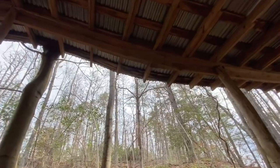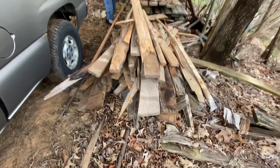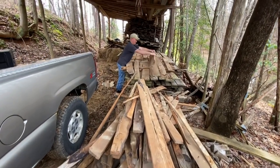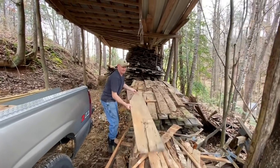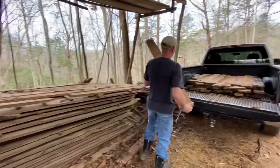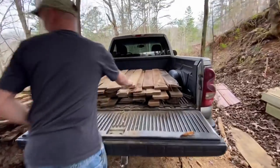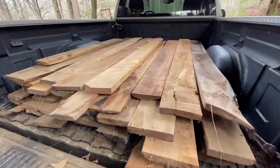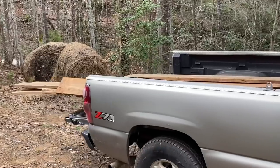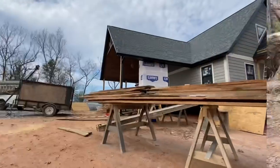The wood was found in a nearly fallen down shed. It had been covered but still weathered just enough to gray some of the boards and give them that trademark barn wood look. We started by pulling layers of the sticker-stacked wood off and culling boards that were too bowed — about half of them. We were specifically looking for boards with varying width and color to enhance the rustic vibe. Since this material had never been kiln dried, I checked the moisture content to make sure it wouldn't shrink after installation.